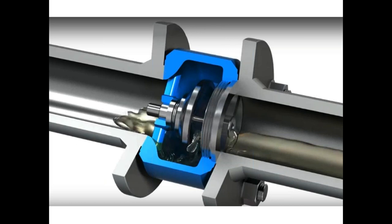So mechanically speaking, I think you can see that in a situation where you're inside the 5 to 10 pipe diameters, the flow is turbulent, and the disc is constantly seeing more pressure on one side than the other, a dual guided disc system would stand up better in that application than a design that features a single guided disc.